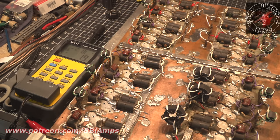Period. End of sentence. If I would have left that piece of phenolic in here, this one section would have run differently than all the other boogered up piles at the end of this box. So please believe me and hear me when I say, if you don't know how to do these trace repairs, call me and I will explain to you.